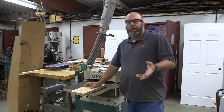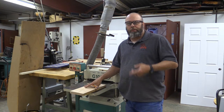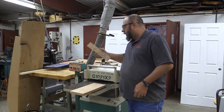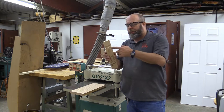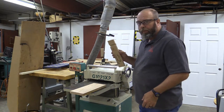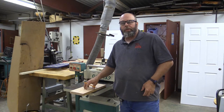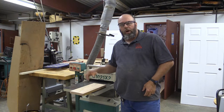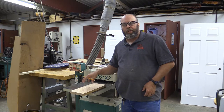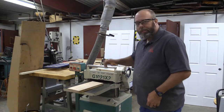One of the first or second steps in processing a board is to get it down to thickness. We did the first step — rough cutting it to length. Now we're going to plane it to ¾ inch thick. This one's pretty important because our dado slot matches our gauge block, so you want to be at ¾ inch pretty much on the dot so it fits in there snug. If you want to do the striped option, follow all the procedures from the cutting board video, do all those steps, and then plane it down to ¾ inch. Otherwise, let's get started.